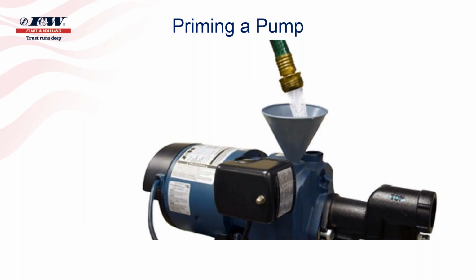Most, or I should say, some pumps will have a priming port. In other words, there's a plug that you can remove on the top side of the pump housing, and you can add water through there. Or a lot of contractors on the discharge side of the pump will incorporate some type of a T with a plug on the one end of the T so that they can remove the plug and add water there.